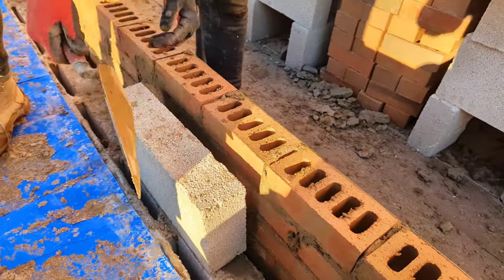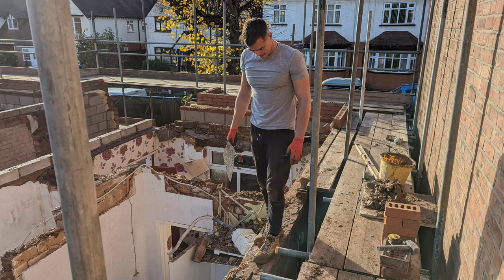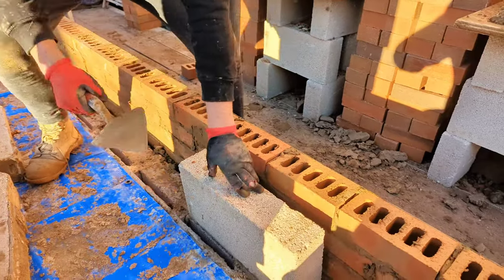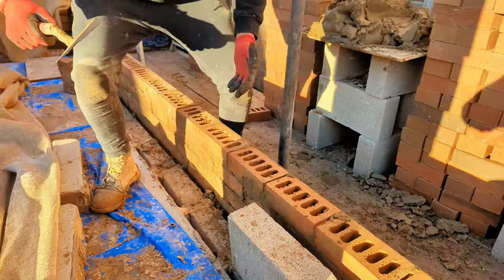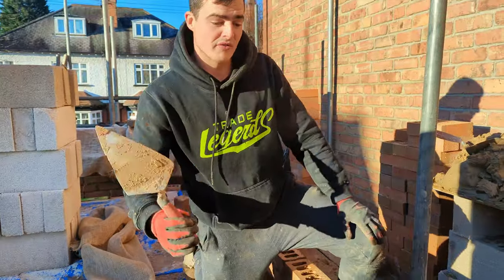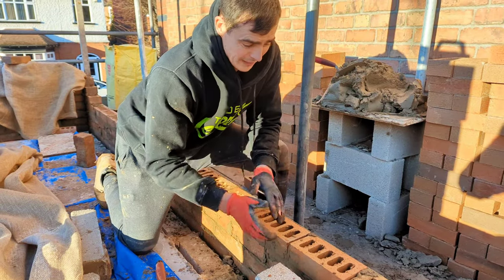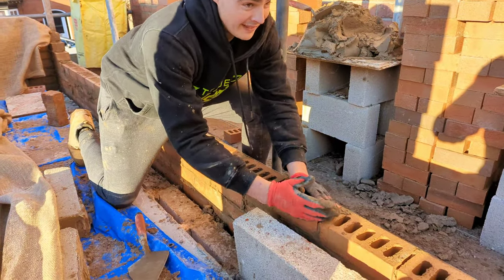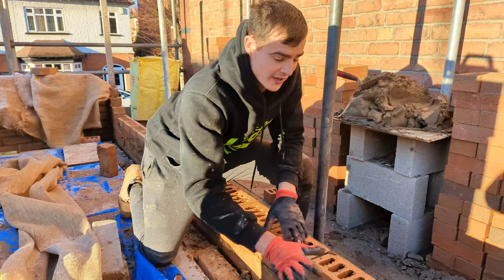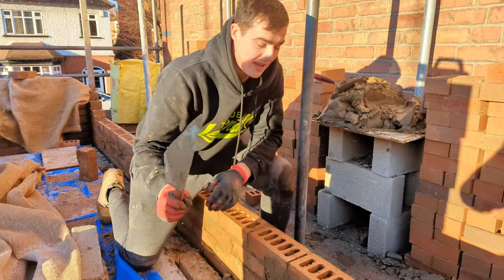Brickwork panel going up. Something else you lads might have noticed, this is a 9-inch wall. This is because this brickwork, the blockwork and the joists are all sitting on the existing brickwork off the old house. This is the only original wall which we have left. Because we've not got a cavity, when we send this blockwork up, it's going to be battened out, it's going to be insulated. This therefore will make this a nice warm wall. Another reason we've gone for a 150mm cavity is to make the overall U value of the house decent, because obviously if you've got a 9-inch wall, you're going to lose a lot of heat. However, if you've got 150mm insulation, cavity walls everywhere else, this is going to counterbalance these colder walls. However, we are going to batten this out, so we shouldn't have any problems.